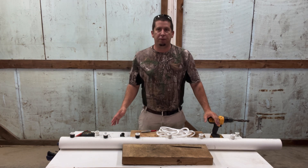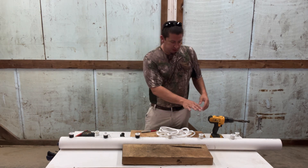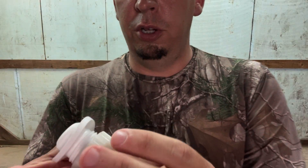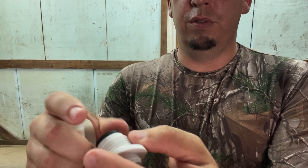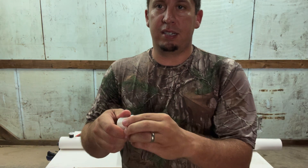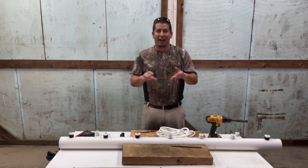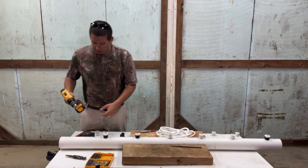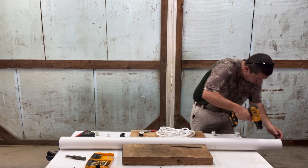I've got a five-foot stick of three-inch PVC, which matches the width of my Ranger. I've got seven fittings to go in — I'm going to drill a hole into this PVC for each one. I need a 7/8-inch drill bit. You glue the end onto the three-inch PVC, there's a rubber washer where you feed the rope through, you feed this through as well, tighten that up — it's like a compression fitting that prevents leaking. The first thing I'm going to do is drill my seven holes for my initial boom. You don't want to jump right into a 7/8 bit because it'll spin all over the PVC, so start with a really small bit just to get a pilot hole, then drill your big bit.